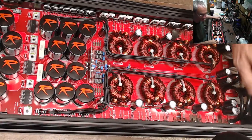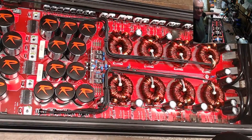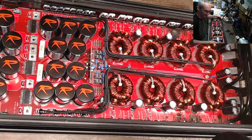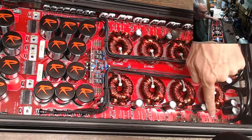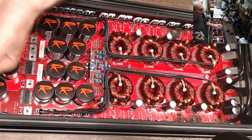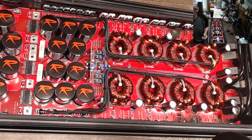Tighten your end screws every now and then with your big builds. Get down and tighten up your end screws — when those end screws come loose, this mounting plate bracket end plate will actually move enough to break the legs off the transistors.